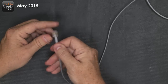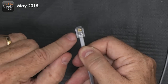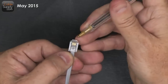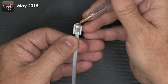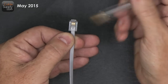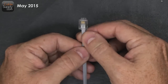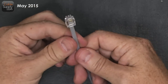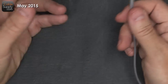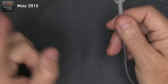Anyway, to make a long story short, the official name of this little plastic thing is called a six-position, six-conductor plug. But in this case, this is a six-position, four-conductor, because it has six positions but only four conductors. All you really need is a six-position, two-conductor for it to work for 99.9% of devices. So we're dealing with this silver satin telephone cord. It looks pretty good; everything else is working fine. Do you want to throw it out? Well, it's up to you, but you can also salvage it. What we're going to do is cut this end off, put a new end on, and I'm going to show you how to salvage it.